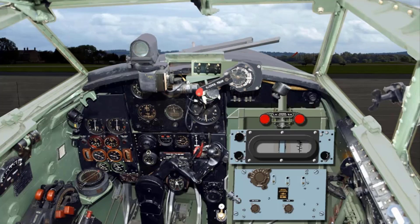Remember, prolonged ground running is likely to damage the exhaust system and should be avoided. With 150-grade fuel, idling the engines at low revs per minute will cause lead to deposit on the sparking parts. If all is well, it's time to taxi the aircraft.